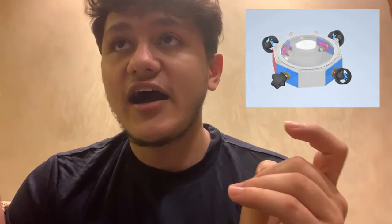For this year's AUV, the mechanical design of the main chassis housed one of our most noticeable changes. The octagonal design allows us to neatly align our mechanisms on flat panels all over the sides while providing radial symmetry, which is really useful for mechanisms that require multiple positions. For example, some of the side panels allow us to mount our thrusters, some are used for our torpedo launchers, and some are just side view panels for the internals.